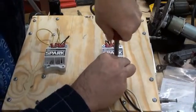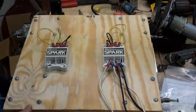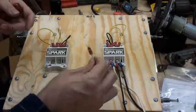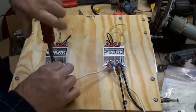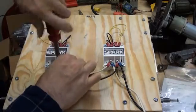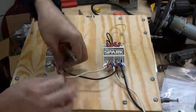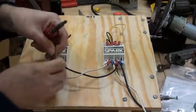One of the reasons the Spark motor controllers are excellent for this application is it's very easy to make multiple connections with the screw terminals. If something is wrong — like one of the motors runs backwards — to swap its direction you just loosen the screw and swap the terminals. Much easier than unsoldering and re-soldering. We'll take this jumper wire and jump it over to the other positive terminal on the other Spark, and the same with the negative. Lastly, we'll take our BEC and steal power off this set of terminals, putting the negative with this negative and positive with this positive.